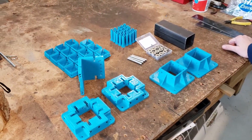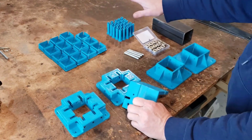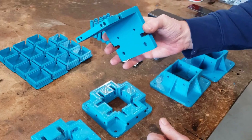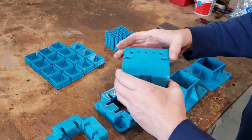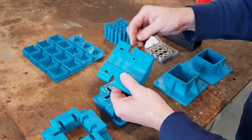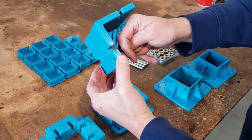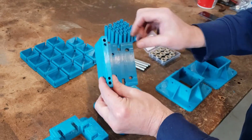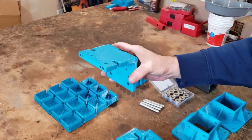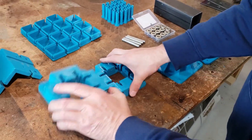We think we finished up printing all the 3D parts we needed for the CNC plasma cutter. We already showed the standoffs and the end caps. We made this piece — this is going to be our X-axis. We're waiting on the bearings to come in, but we'll have one set of bearings running this way, another set running that way, and in these slotted holes another set. Those will have a set screw to make them adjustable and able to run on that square tubing.